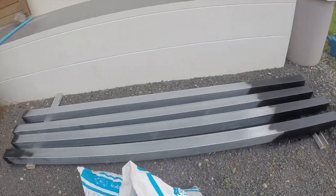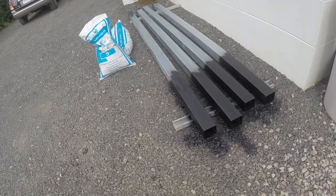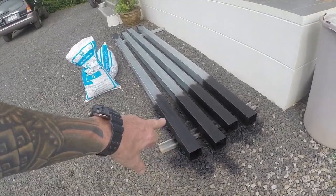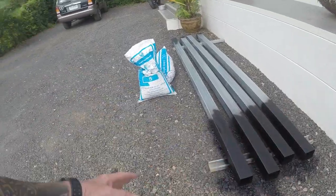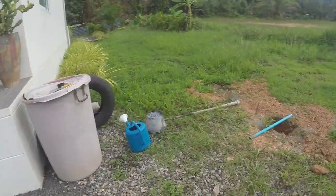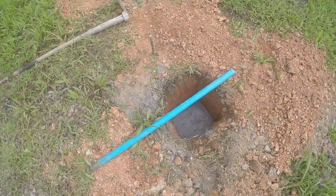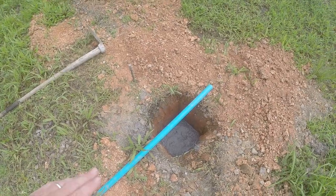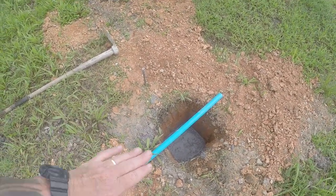As you can see, 3-metre steel uprights — 4x4s I believe. I've got some bituminous rubberised spray that I've sprayed inside and on the top that's going in, a bit of type 1 and some cement. So the holes have been dug out — two of them today — and I've just put a small concrete base in. That's cement, sand, and type 1 to make it strong, and that's the base.